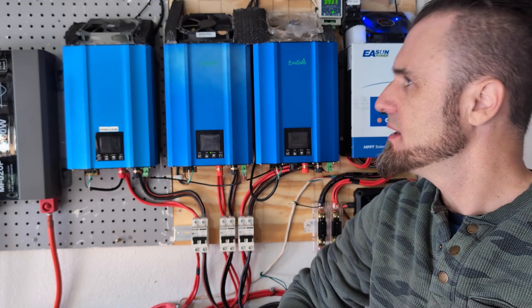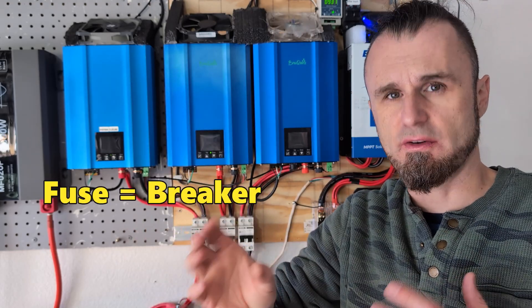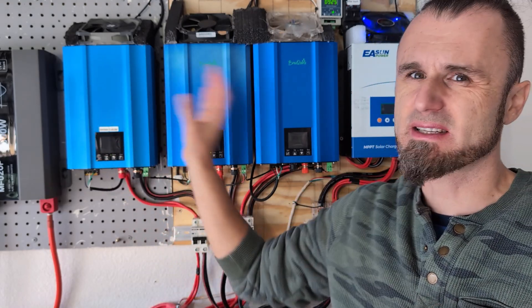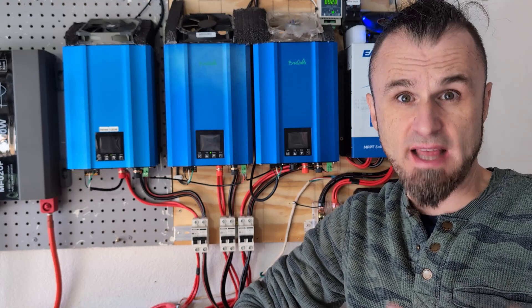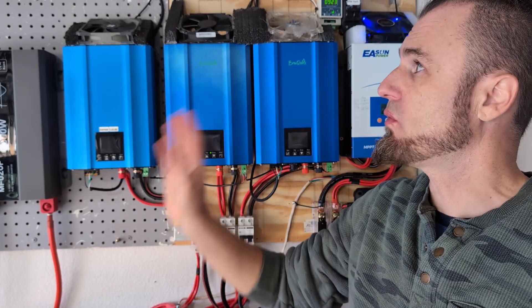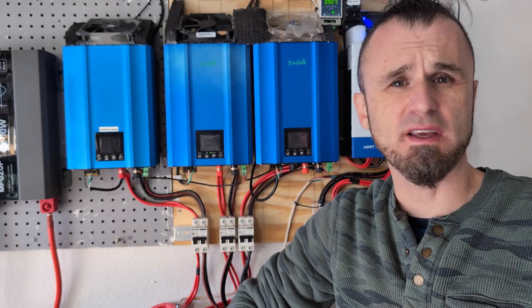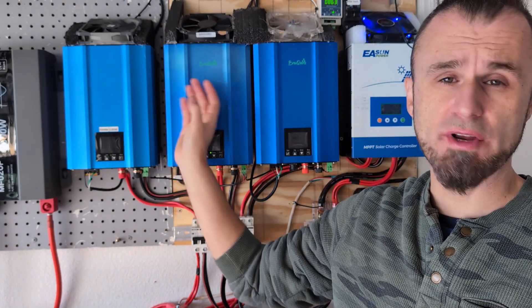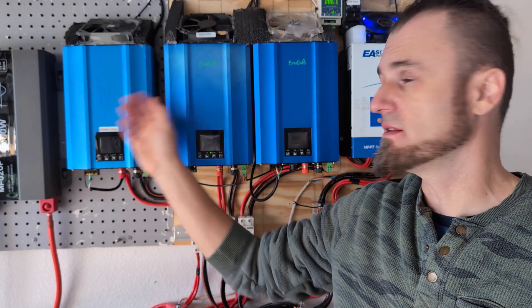To be safe, let's say seven amps each. So if you put two of these on one line, you need a separate fuse in the fuse box. With a 15-amp fuse, you could safely put two of them on that circuit. The fuse is there to protect the wire carrying the power inside the house — rated for 10, 15, or 20 amps. Two units pushing seven amps each means you need a wire and fuse rated for 15 amps.